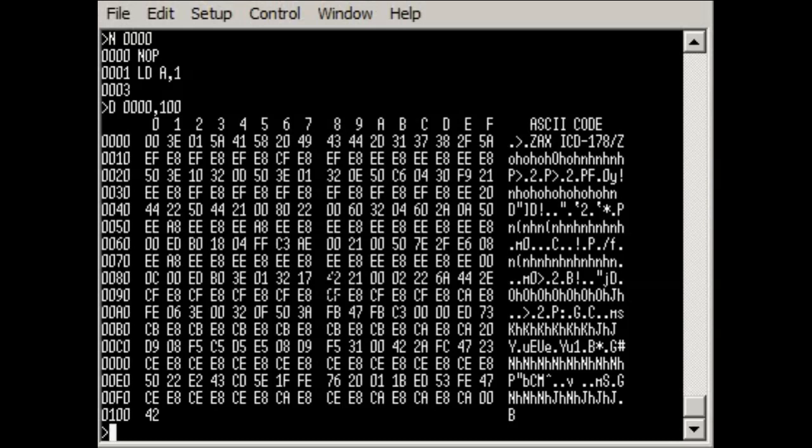You can do this on a target system or within the emulator memory. You can run it at full speed, you can trace the operation at full speed. You can then disassemble what the data is that's being captured. So all in all, a very powerful system. And the intent here was not to really show you the repair of this. I was hoping to go straight on to the Windows software development. So I'll be trying to encapsulate all this in a Windows application to make it even more seamless and functional than it is through the terminal.